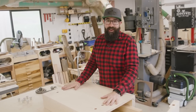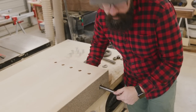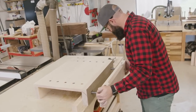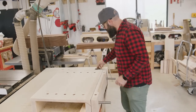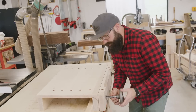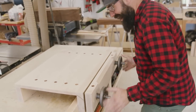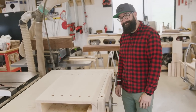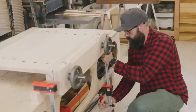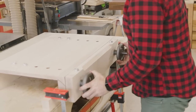Well, that was a fun adventure. This is all fixed now, so we can get this hardware mounted and see how this thing looks. I'm going to set this nut here in that mortise that we made and then tighten this one on the back. Now we're going to put our movable jaw on here, feed that on, get some washers on, get some handle tighteners on here. Let's tighten up the vise. That is nice and tight — that's a nice vise. Let me get these bench dogs on real quick. Obviously this is to keep the whole system in place while you're working on it, because you're going to be doing some pretty heavy duty woodworking on here. That's really nice.